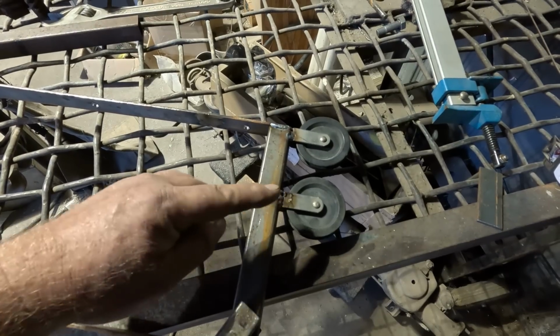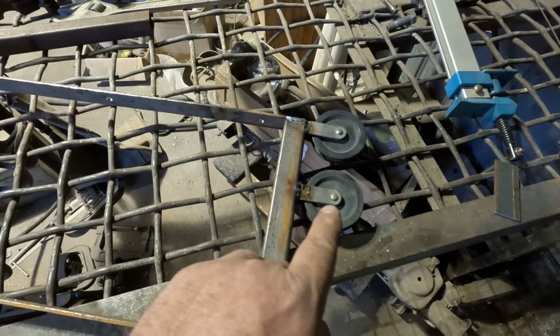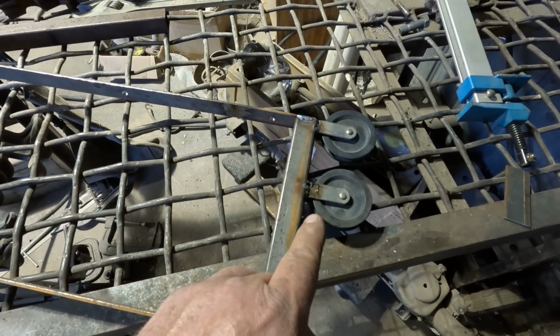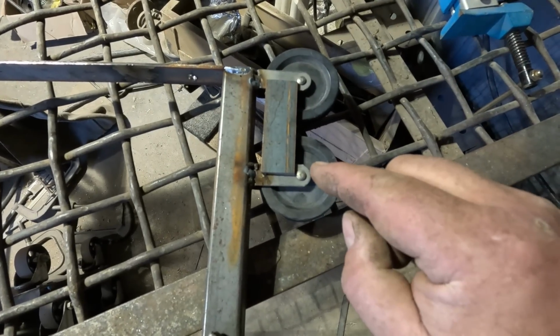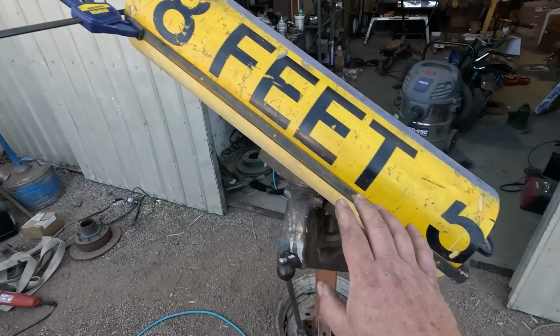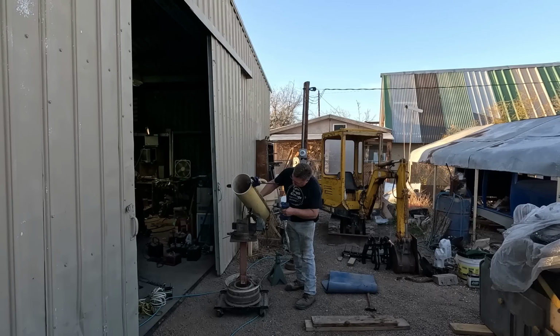Earlier I mentioned that these pulleys are designed to be in tension. I'm going to run a rope around them, putting them both in compression and a side load on it. So I got to strengthen those up a little bit, which should be easy. I got my outside piece all welded up with my pulleys in place, and I'm sitting on the barrel. Now I just drill through all the holes into the tube.